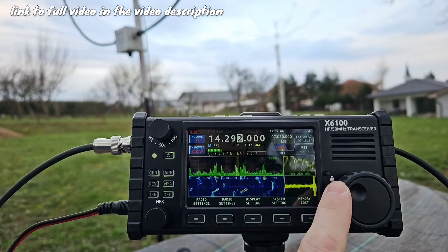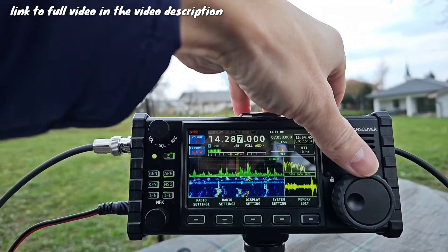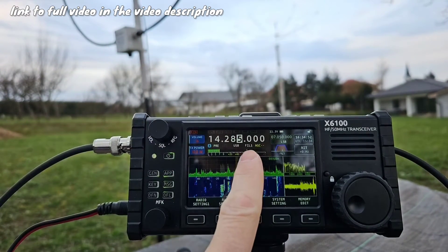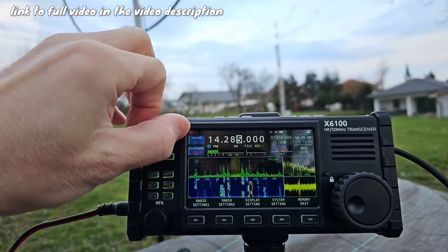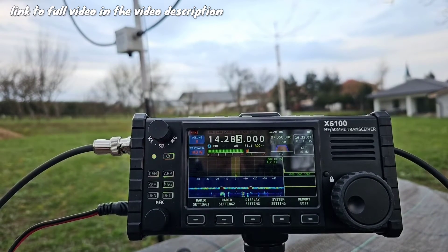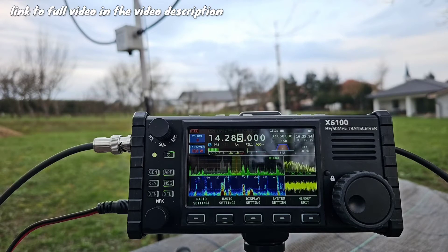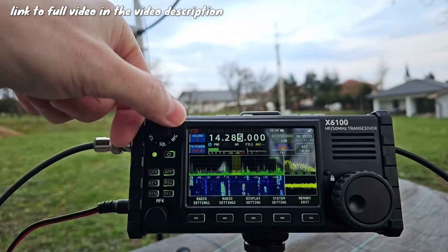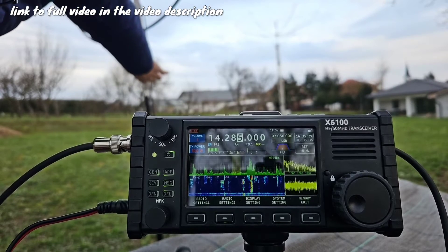The antenna is very sensitive. As you can see, I moved from the center frequency a little bit to the side, and if I go back to AM mode you will see a change in SWR — the SWR is slightly higher. Mag Loop antennas are mostly very narrow band, very sharp. So if you wish to get the best SWR, you need to go back to the antenna, switch to AM mode, and gently tune until you can see the best SWR.